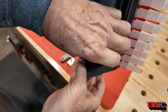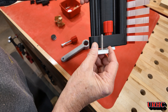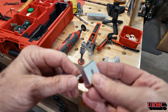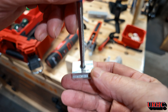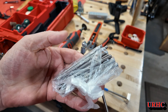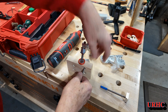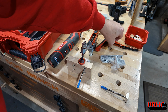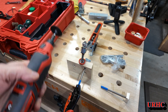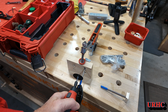I decided to use T-slots — these are from that Gon-Make thin rip jig. I tried them out first. I went out in the shop and made a couple. I had some aluminum stock and I machined out a couple of M6 threads. I had some M6 studs, 100mm — longer than what I needed. I just super glued them into the threads and put them in the aluminum block, then I'm going to go back and cut them to the length I need. I used that rotary tool with a cut-off wheel — seems to make the least mess and is easiest to use.